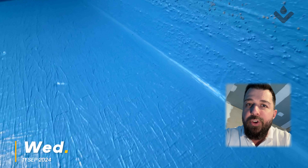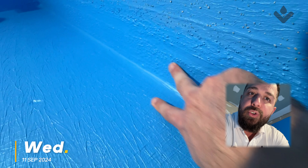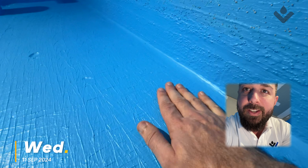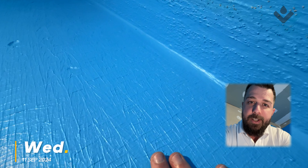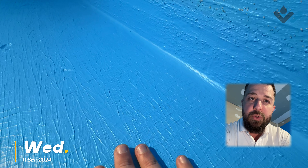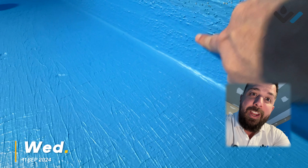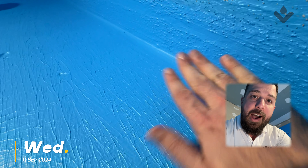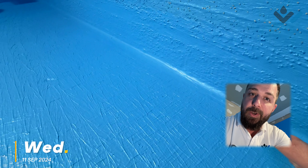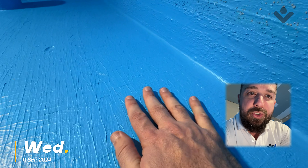However, when we get over to our wall-to-floor junction here, you can see that the crosshatch pattern stops. I can see a very distinctive pattern on what's gone down with their second layer, and it really does look like only the main flat floor area was coated, which is a little bit disappointing. Waterproofing needs to be full thickness - that's achieved with two coats - not only in the flat area but probably more importantly on your vertical junctions as well. I really just can't see that second coat here.